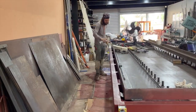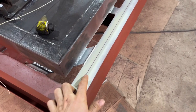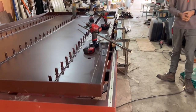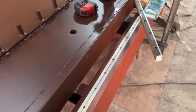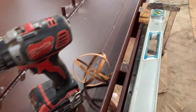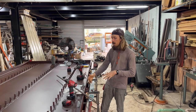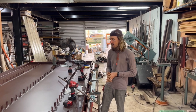That marked line shows exactly where we need to put the circulating linear rails — mark out the holes, drill all the holes, fit it in place and check everything. We can always play with the holes a little bit and wiggle it, but we want it as close as possible. We also have a long level to help hold the linear rails straighter, since they're not perfect from the factory.